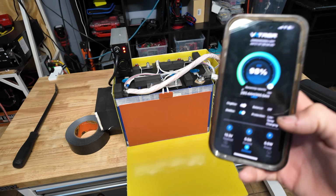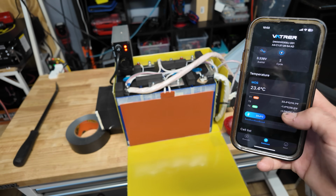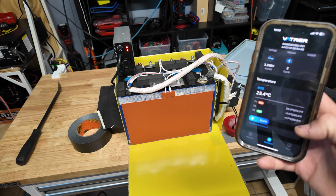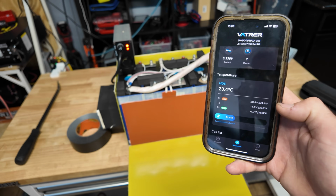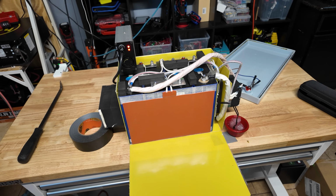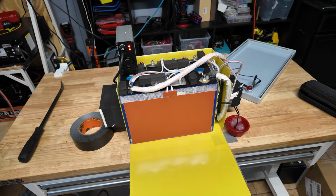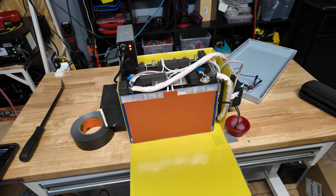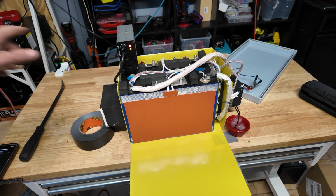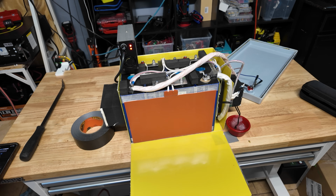All right, so I'm getting it to bounce between low temp charging protection and low temp charging off. And the sensors are both reading below freezing. However, the T1 sensor, which I believe is actually in the BMS itself, is still reading normal. So what I think is going on is either I'm not getting the temp sensors cold enough, or because there's a conflict between the BMS temp and the temp sensors, it's not gonna let the low temp charging activate fully because the charger is still charging. But I do see on the BMS that it's trying to activate. So I do believe it actually does work.